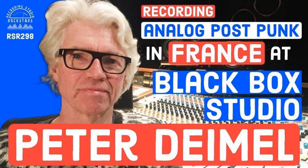How would you describe the sound of stone — if somebody was imagining building their studio with stone and wood? The stones are very porous, so they're not that reflective for the very top end. You get a dense reflection. It depends on the size and dimensions of the room. Our drum room — which is what we call it because we do lots of drums in there — has a high ceiling, maybe eight meters, with wood ceiling, stone all the way around, and a wood floor. The sound is very reflective, lots of early reflections, but the decay doesn't sound that long — well under a second. It sounds very dense, not too bright.